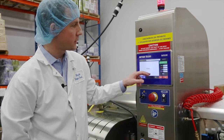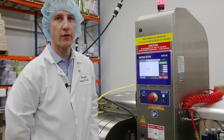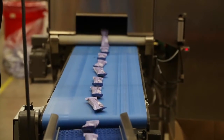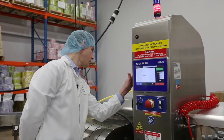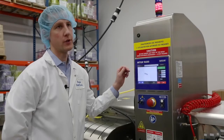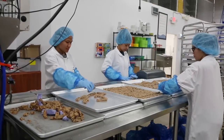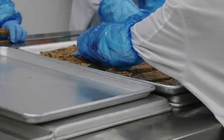Anytime we're seeing a clean image and it's okay, product is passing through — it's safe for consumption and we're good to go. We're calibrating at one and a half millimeters for metal, so anything that's roughly a millimeter or bigger will typically be picked up.